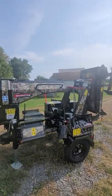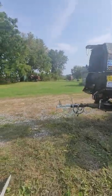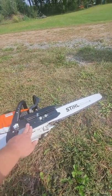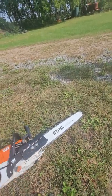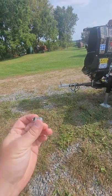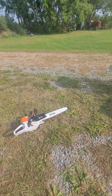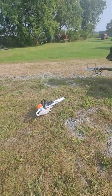We did have a few little hiccups. For those of you buying one with a Stihl chainsaw, be advised that when you attach your adapter plate, the screws that hold your plate on — these guys here — you're going to have to either push them out or cut the burr edge off, otherwise it will not adapt. They may be working on a fix for that in the future.